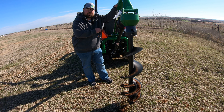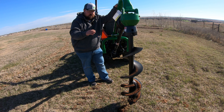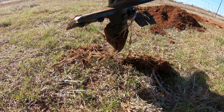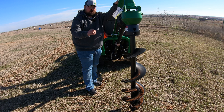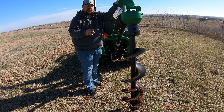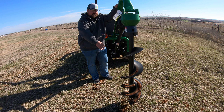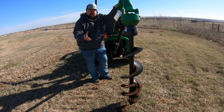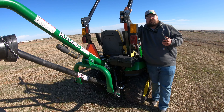These augers also come in a couple of different lengths. Here on this 1025R, which is what I have this PHD200 hooked up to, we have a 48-inch auger on here and it is almost too long. When traveling with this machine, you can see just how little ground clearance we have — if you get any bounce at all with your tractor, you're hitting the tip and possibly damaging it. When working with the 1025R, you may definitely want to go with a 36-inch auger rather than a 48-inch. The 48-inch is what came with this model so we went ahead and used it, and it worked just fine, except that it may be just a little too long. Sometimes for certain applications you'll need the 48-inch to get enough depth, but if you can get away with the 36-inch on the smaller subcompact tractors, I would highly encourage looking into that.